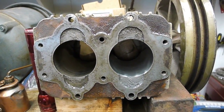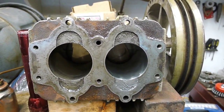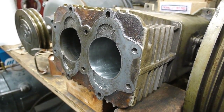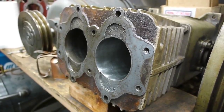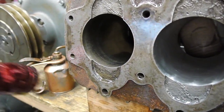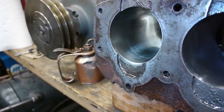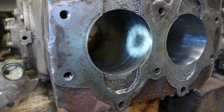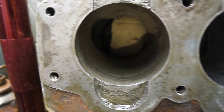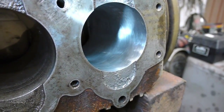This is a quick video on honing a Quincy model 230 single-stage twin-cylinder air compressor. This compressor is dated 1968 and has a lot of hours on it, but the bores actually look pretty good after all these years. There's some rust pitting and light scale on the cylinders, so I'm going to break the glaze off and hone everything nicely. You can see I already did the first cylinder and it came out really nice.